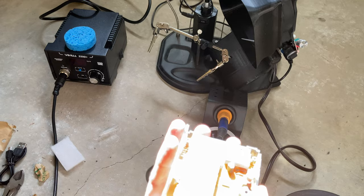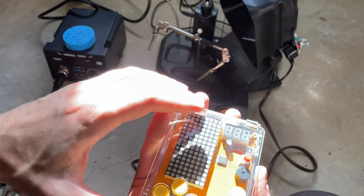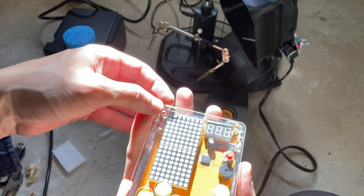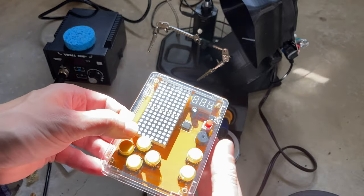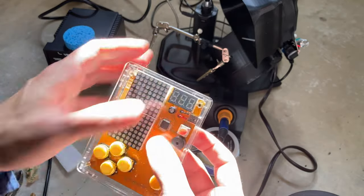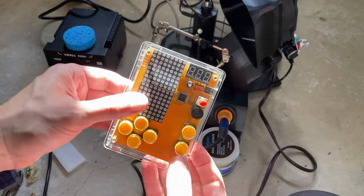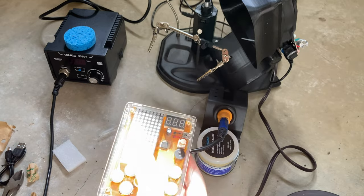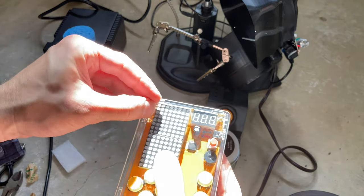So then you hold it level. Now you're going to drop the front plate on and make sure it lines up with everything, so all your corners and tabs and the keys and pins and everything else, okay? So once it's aligned, now you're going to take the remaining small screws and put them in every corner and tighten it down.